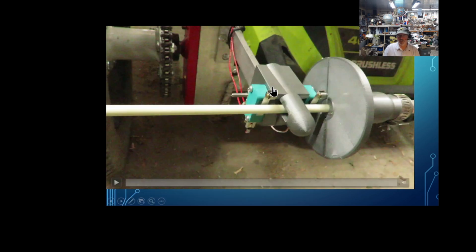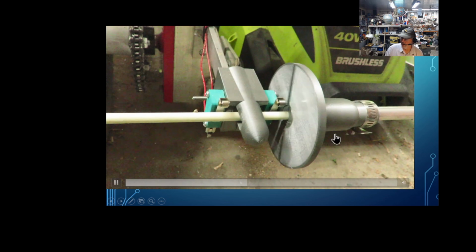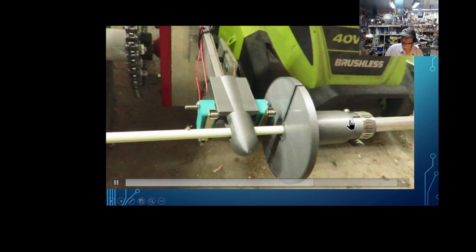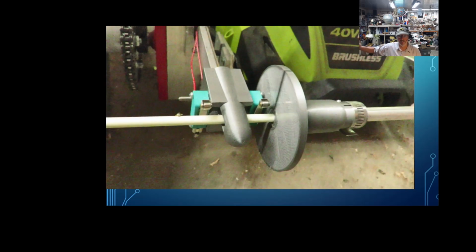Here's my bumpers. Okay, now first off, I'll show you the video of this. This is a fiberglass rod, hopefully it won't break, an aluminum rod open with fiberglass inside, and if I hit anything, it hits both switches, and there's another set of switches on the other end. This disc right here is just to keep it centered. These are all 3D printed. I just welded up a little piece of bar stock, welded it onto the end, 3D printed, and bolted on the system here. Now, some of these switches are normally closed, and some of these are normally open depending on where they go to.